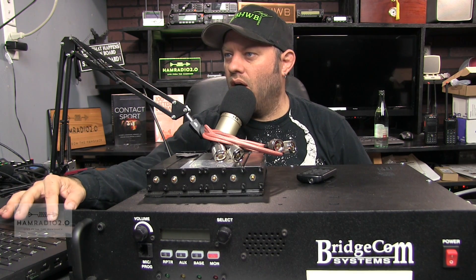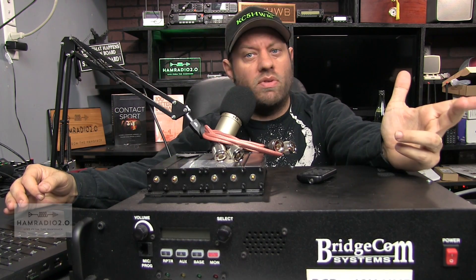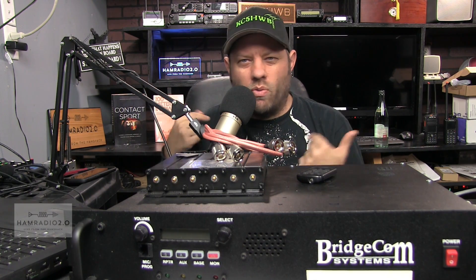When you're programming your repeater, you're going to want to program it as wideband — not 12.5 kilohertz, but 25 kilohertz. That surprised me, but that's what they say to program it as. They also said you don't have to run a PL-Tone, but if you do, since it's digital it ignores the PL-Tone anyway. However, turning a PL-Tone on will lessen interference from nearby analog signals. They suggested turning the PL-Tone on and setting it to a different tone than what most repeaters around you use.